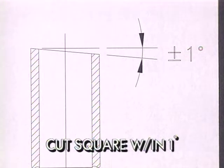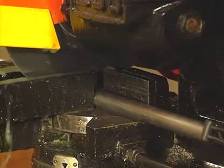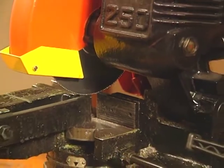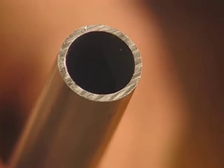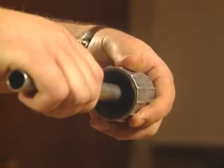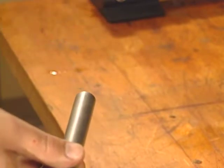To assure the correct tube-to-fitting connection, you must cut your tube end squarely within one degree. Failure to do so causes tubes to rest improperly in a brazed sleeve and fitting body, and flanges or flares that aren't circular. Whether you're cutting a tube end for brazing, flanging, flaring, or pre-setting, always use a toothed blade saw like a hacksaw or low-speed circular saw. Other methods like tube cutters or abrasive saws can cause the tube end to harden, making it difficult to flare or pre-set the tube. After cutting the tube end, you must deburr the inside and outside diameters. This ensures the tube fits properly and without imperfections that can cause leaks. Always use a Parker In-X or power deburr tool.